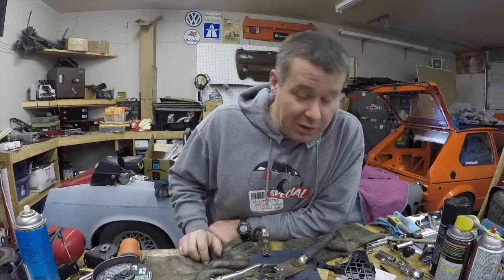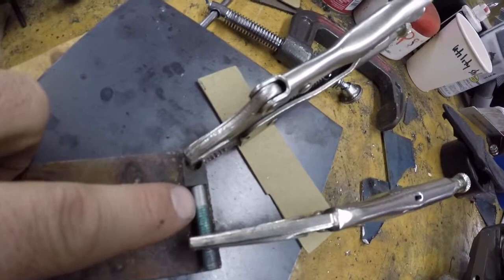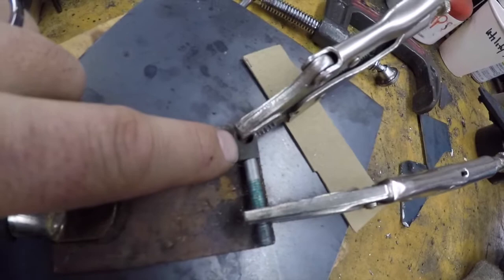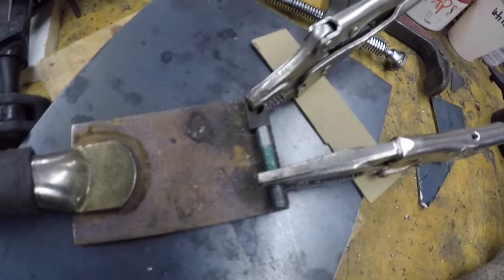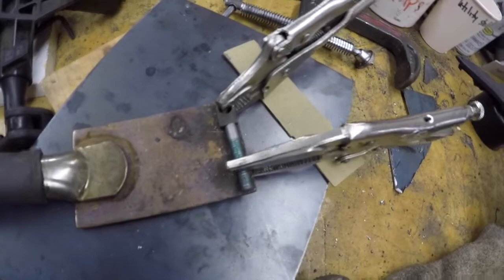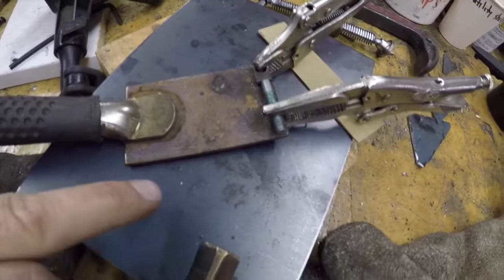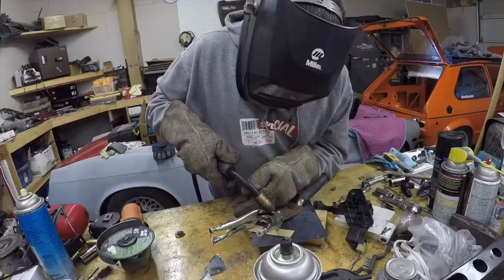It took me a little bit of time to jig this piece up — the first one I did came out terrible, so I got a different bolt. I cut the head off another bolt, cut the piece that goes onto the window, and then clamped it to a little piece of copper because the weld won't stick to copper. I can weld it up, take it off, then flip it over onto a piece of scrap metal to conduct the electricity through it. This will be the part that goes into the piece that snaps onto the armature.